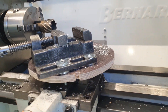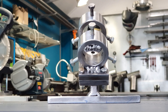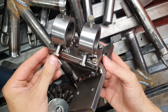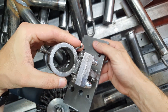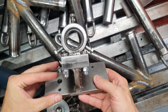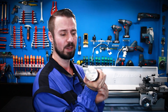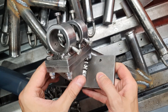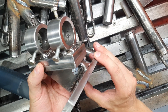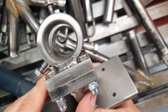Basic V-blocks also aren't great if you need perfect accuracy and repeatability, so I built a custom fixture. It took me about two days to make it. The most time-consuming part was machining these thick washers — I made them from a heavy steel rod, and it took me an entire day to produce just two washers. The pipe is secured with screws positioned at 120 degree angles. I made the base from a 10 mm thick steel plate and welded it using 140 amps to ensure deep and solid penetration. Normally I weld at 70–90 amps, but this time I increased it to 140.